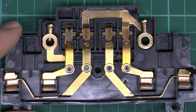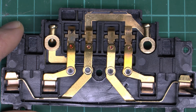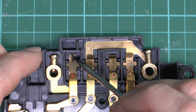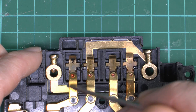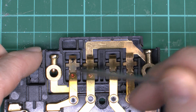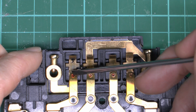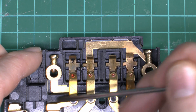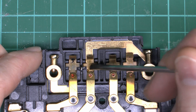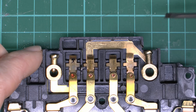It seems that the top and the bottom are actually two entirely separate components — that is rather loose and flappy in there, so it's literally two items just placed on top of each other. Now the way these work is that when the top is actually pressed, that's when the switch is on, because the conductors basically come underneath. So this conductor here is connected to the movable component, and when the back is pressed, that basically brings it up onto the bottom of here, and then power goes through also to the contacts at the bottom. And then the same with this one — it comes in at the top, connected permanently, and then this moving piece is what connects down to the socket contacts.